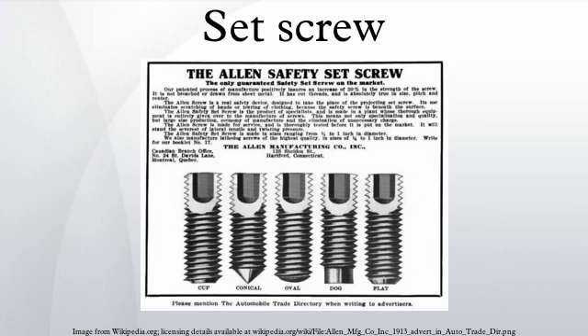This has both pros and cons. On the pro side, such deformation increases the holding power of the joint, as the screw is essentially making its own detent on a small but effective scale. On the con side, if one is aiming to have a blemish-free cosmetic finish on the part being set against, one must take actions to prevent the circular marks. In most set screw applications, this consideration is irrelevant. Another con is that this plastic deformation can cause corresponding high points in the shaft surrounding the circular mark, which can result in difficulties during disassembly if a bearing or other tightly toleranced part needs to slide past this area. Use of a flat mitigates this problem.